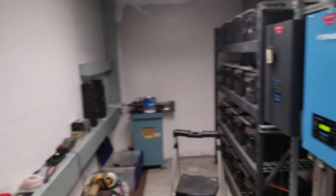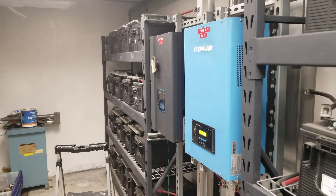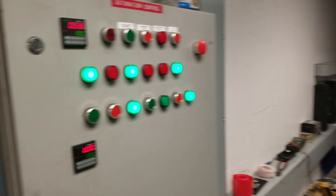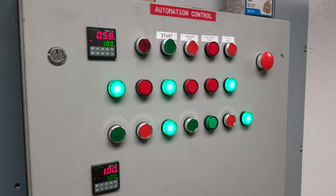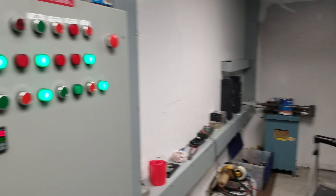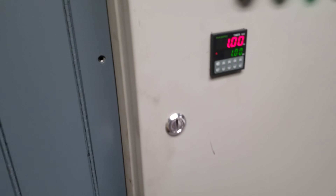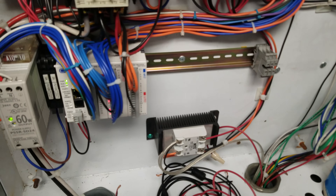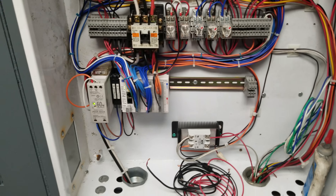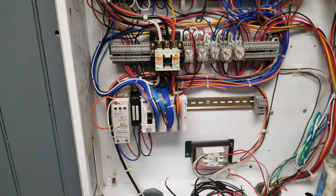Another thing I still need to do is tie into this inverter's power switch, because that draws approximately 180 watts when it's just at idle. I want the PLC to go ahead and turn that inverter on for me when either the generator runs or when the diversion power for the spa kicks in. The diversion power — when we're running on solar and we have, say, a thousand extra watts — it'll only do pulse width modulation on that solid state relay, which only allows a certain amount of power to go through. So I want it, when that starts doing pulse width modulation, to actually turn on that battery charger. Maybe I'm speaking a little over someone's head, but I definitely want to see what you guys think in the comments below.